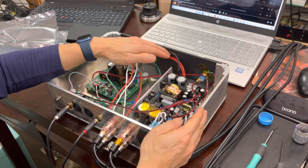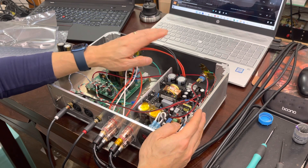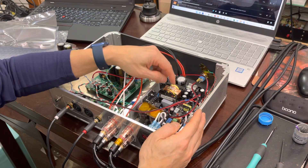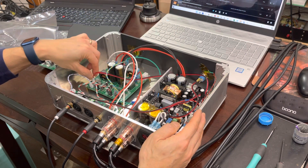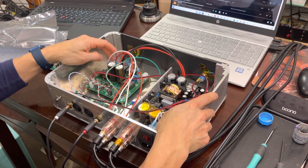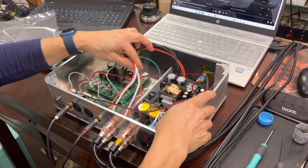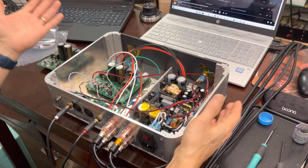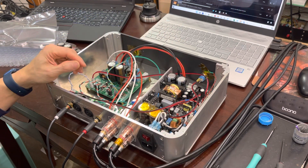In my chassis here, I'm using a Micro Audio SMPS630SO — SO stands for single output. This one is designed for 51 volts output and has a built-in plus or minus 15 volt power supply, which was really handy for powering this. It adds up quickly, but there are 10 connections here for everything involved. But really to get going, you need power, you should have ground to the chassis, you should have your speakers, and you need your audio input. Make sure you've got the polarities correct.